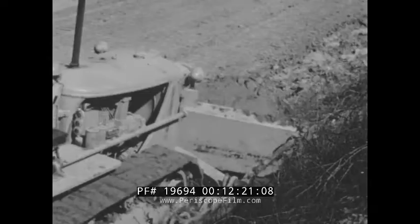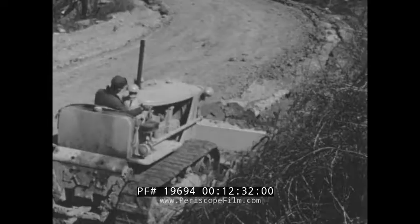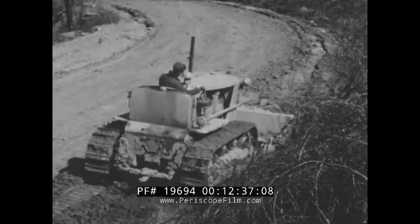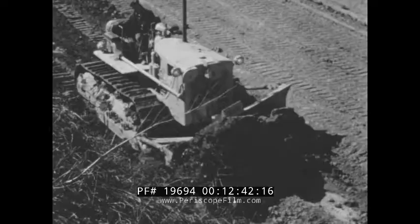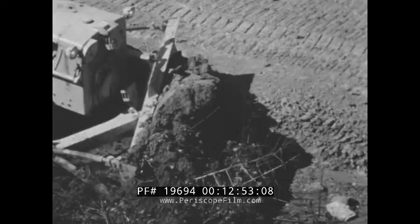A side hill road has a badly clogged drainage ditch and no motor grader is handy to clean it out. So the D7 with the right corner of its angling blade dropped down goes about the business of getting the job done. Once more, the dirt is rolling — but on this job, it's carried across the blade and piled in a windrow at the left of the machine. The silty material is loose and wet, about as tough to move as anything you'll find, but the big blade carries a full load and opens up the ditch at a single trip.